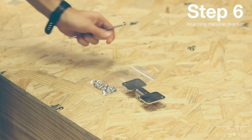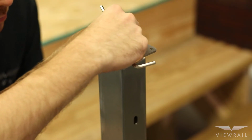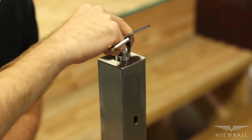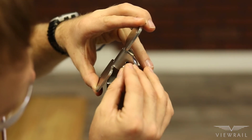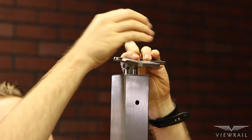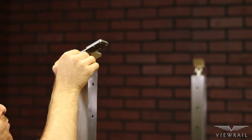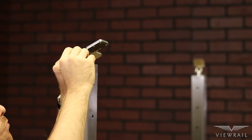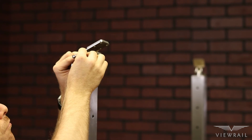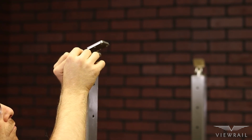Step 6. Attaching the handrail bracket. Position the handrail bracket on top of your posts and attach it with the provided screws. If your system utilizes corner posts, make sure the bracket is oriented so that it turns the corner the correct way. If your system has post side handrail brackets on transition posts, check out the video at the link below to see how to install it.